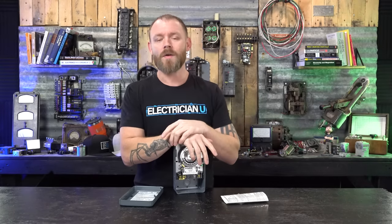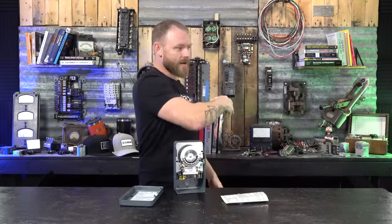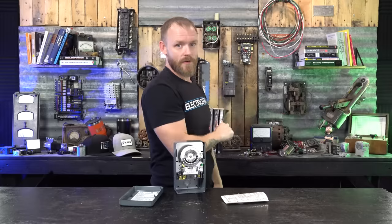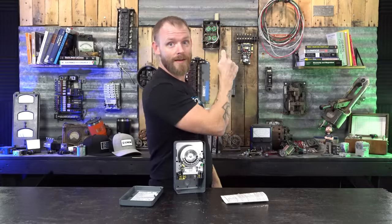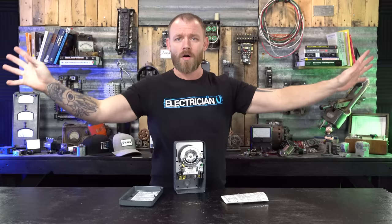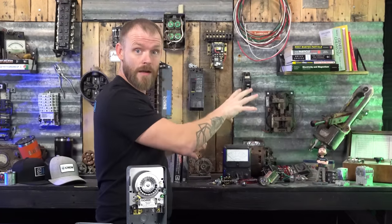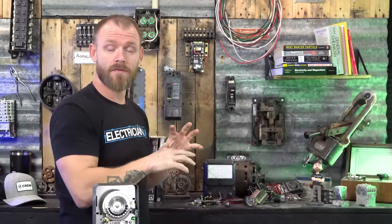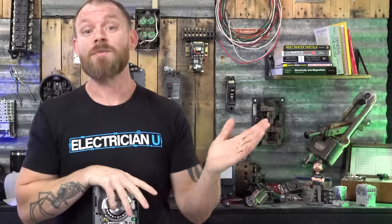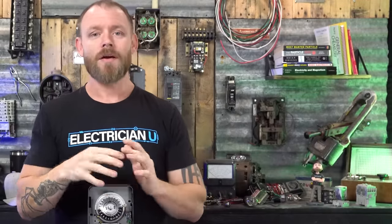Other ones, they don't have any remote monitoring, they're just a huge panel with breakers and there's like a little LED panel on the front and you can hit a button to turn pole lights on, you can hit another one for wall packs. So they're programmed and it's a way to program all of your lighting so that you can go into the settings, have it turn certain relays on or certain contactors on, turn them off for different events and have manual override and all that. That's the best case scenario. But a lot of the properties that are older, cheaper maybe, they're going to have stuff like this.